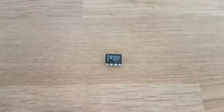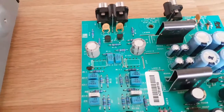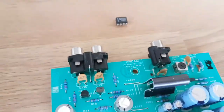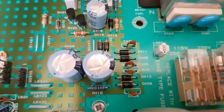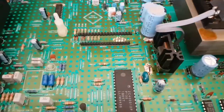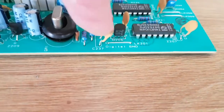Whatever chips you put in, it's very important to replace them — they're like power amplifiers. You wouldn't use a junky cheap power amplifier in a system with very good speakers, so you use the very best you can afford. Now, if I wasn't going to build an external power supply, this is what I would do to an Arcam Alpha 5: replace those diodes there, and the capacitors on the board with Panasonic FCs. I'd also do some decoupling and change some better quality resistors — carbon film instead of carbon composition. And on the audio board, these decoupling capacitors are getting replaced with something much better.